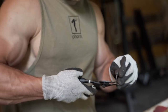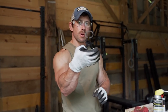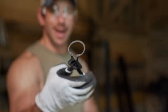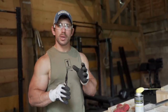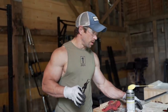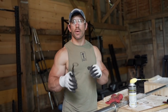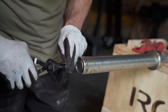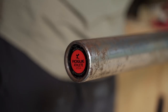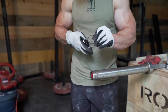There is a difference between the snap rings — look at the edges. The edges are a little bigger on one snap ring, and that was the one that goes on the inside. Pay attention to which snap ring goes inside versus outside to pull the end cap in, because they are different for a reason. Make sure the bigger-edged snap ring goes on the inside. The last end cap goes back on, then the final snap ring with the smaller, more rounded edges.